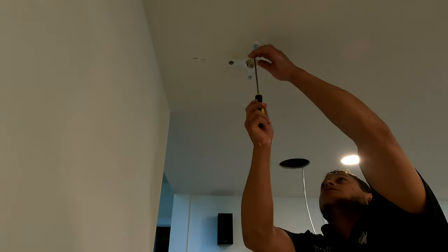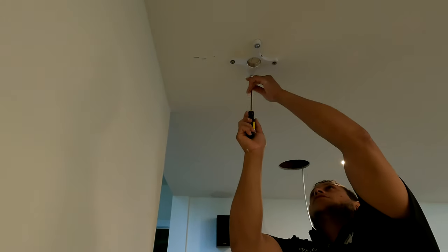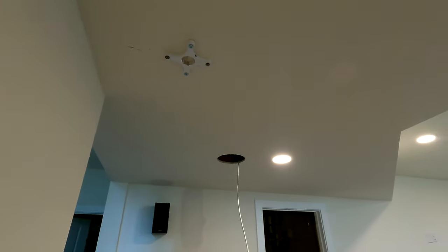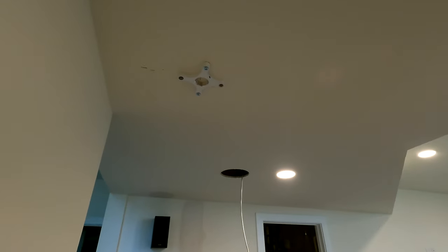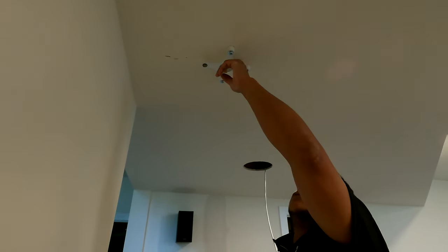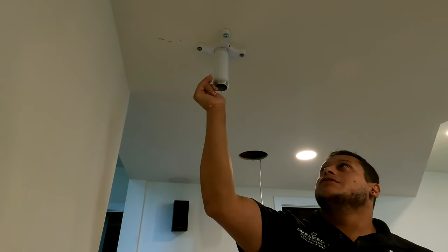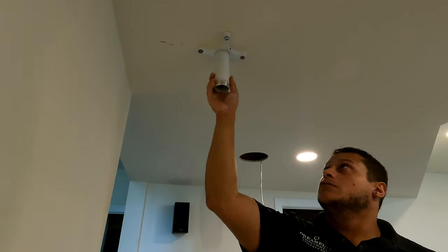The last thing I would say here is let's check the torque on the toggles because I saw her pulling the drywall a little bit, which means she's tight on those studs. Yeah, this is good, torqued. And torqued. All right, all 4 are good, all 4 are up. Now, a locking screw probably should go in the back. But for all video intents and purposes, let's continue.